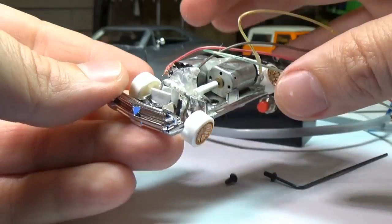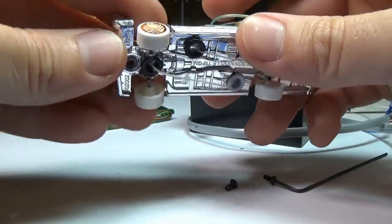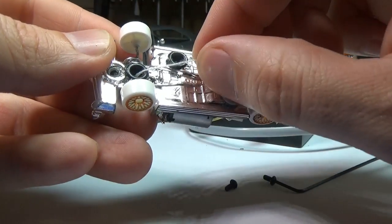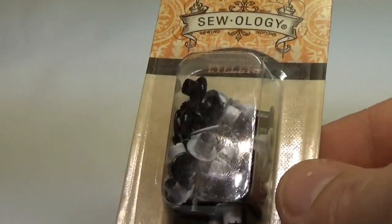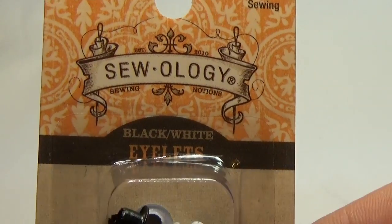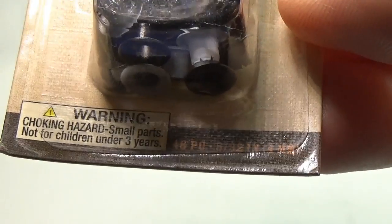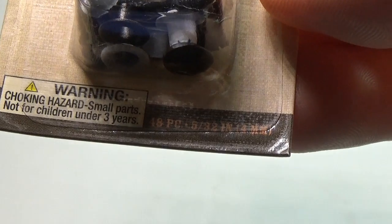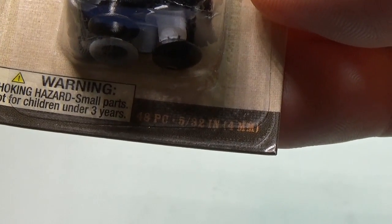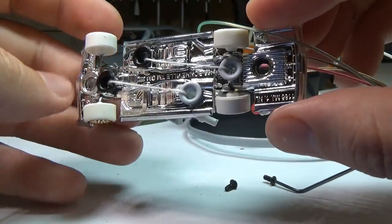So you'll notice that the axle has a small string glued to it. The string is then threaded through a hole and an eyelet. The eyelet protects the string and keeps it from getting bound up. You can find these eyelets at Hobby Lobby in the sewing section. They come in different sizes. Try to get the smallest one possible. Then use a drill just a little bit bigger than the eyelet to drill your hole in the middle of the axle groove, and then insert and glue the eyelet. Be sure to do this before you put in the groove walls, otherwise the drill bit may damage them.